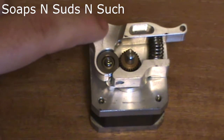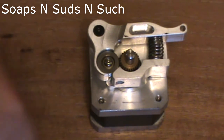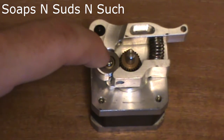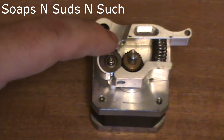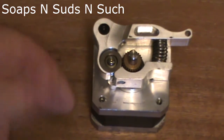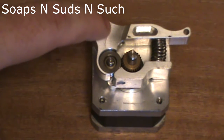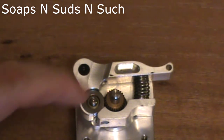The hardware holding it together is different from the hardware I unpackaged in the first video. That's because from swapping this plate over frequently with another plate, I found that the screw that came with it was not great quality — with repeated unscrewing and re-screwing it was starting to strip. That was the problem I had with the original screw holding the leveling arm on. So I swapped back to my original hardware after my original stripped out, and it's been working fine.